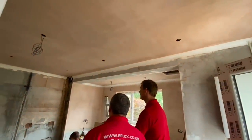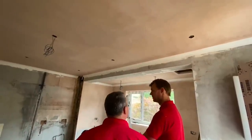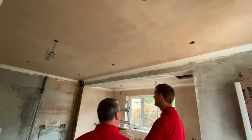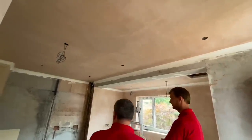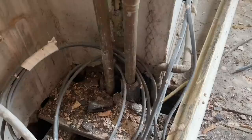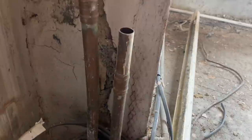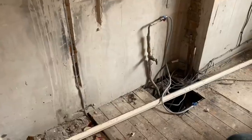Looking into the kitchen, I see a number of spotlights — have they carried that theme out through the house? No, I think there's only the kitchen and the bathroom with spots, apart from that. So you got away with that one, because normally for mates you'd have spots everywhere! Over in the corner we've got what looks like a lead pipe coming in for the water, so protective bonding is going to need to be installed. It's currently under the floor ready to be connected — we need the plumber to come in.